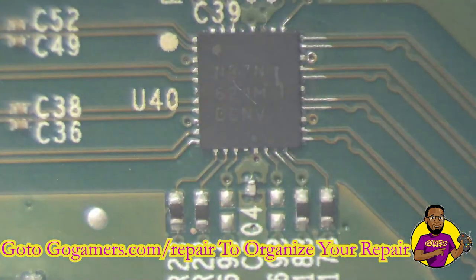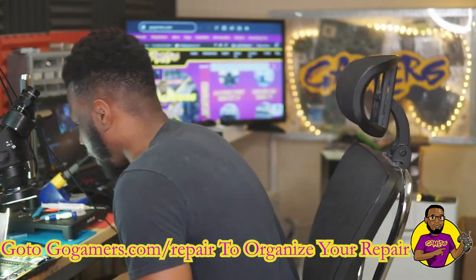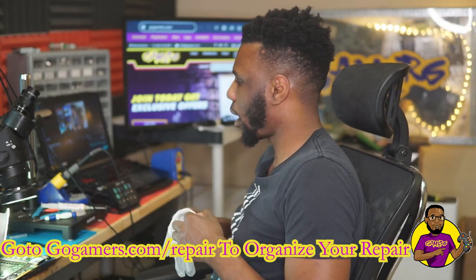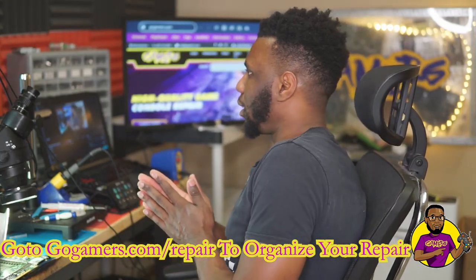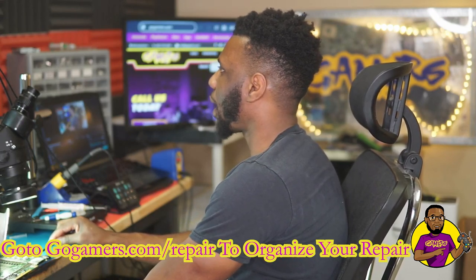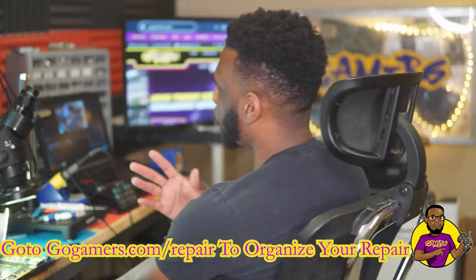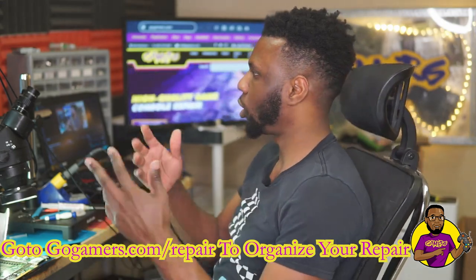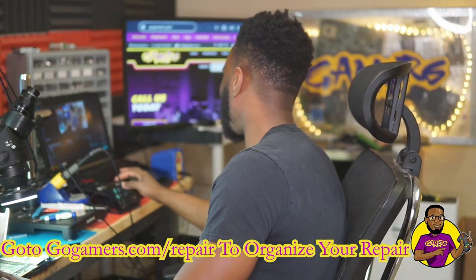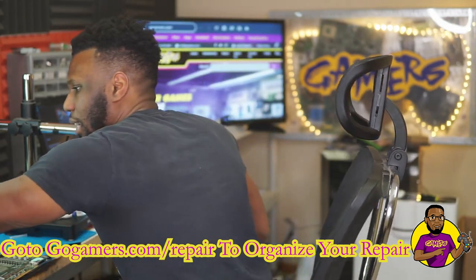Just to give you more of an idea of how I got this completed — I placed the chip down, used my 8341 no-clean flux, and used my soldering iron. I went around with my angle tip and then my flat tip to get in there, because it's a bit more difficult working with ICs where you don't have much wiggle room to reach the copper pad. It took me a bit longer than working on an Xbox One X, but I'm hopeful this should fix the no-video problem.